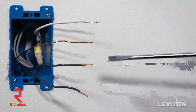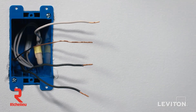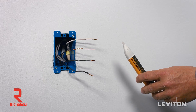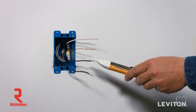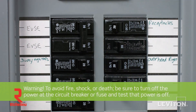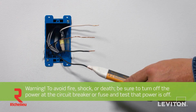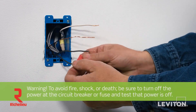In this example, there are two black wires and you need to determine which one is the line or hot wire. To do this, turn the breaker on. Carefully use the tester to test each wire — the hot wire will be indicated by the voltage tester. Once identified, turn off the breaker to shut power. Test to ensure the power is off. Use a small piece of electrical tape to label the line or hot wire.